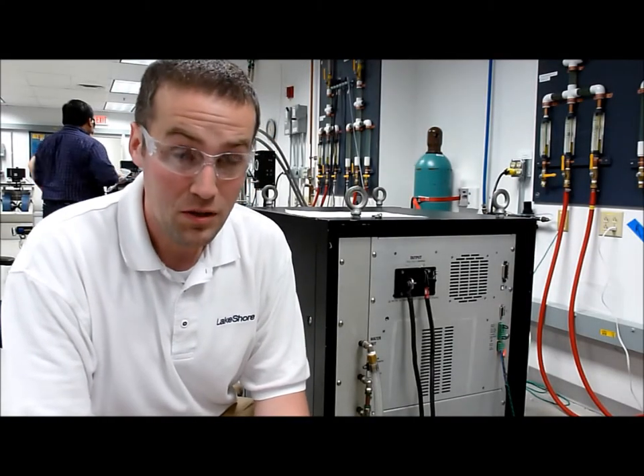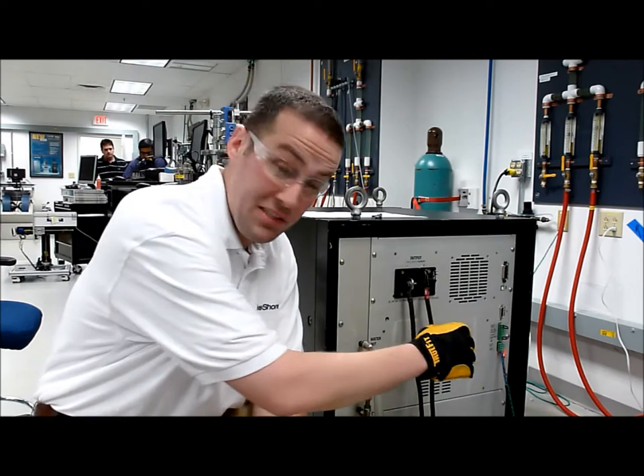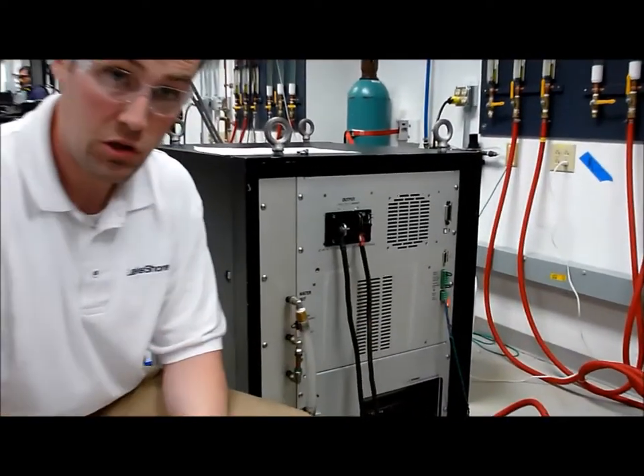The purpose of this test is to verify that the power supply isn't permanently damaged, and we're going to be able to see if the load is suddenly removed. Right now we have the power supply outputting 135 amps DC into a half-ohm load. What I'm about to do is simply yank the lead off, which will simulate the fault condition of removing the load.